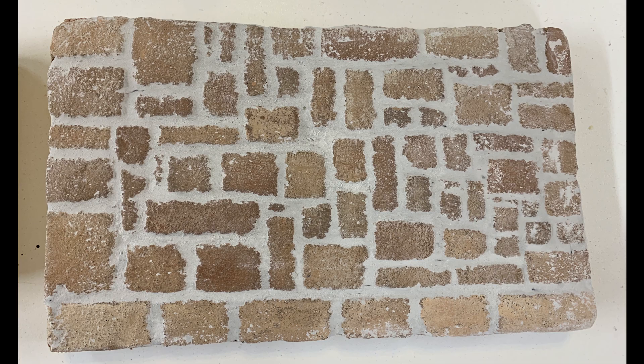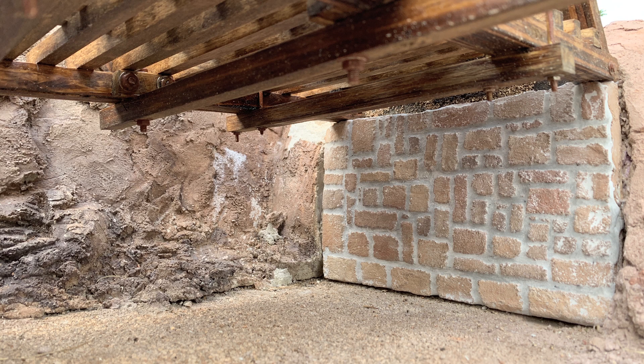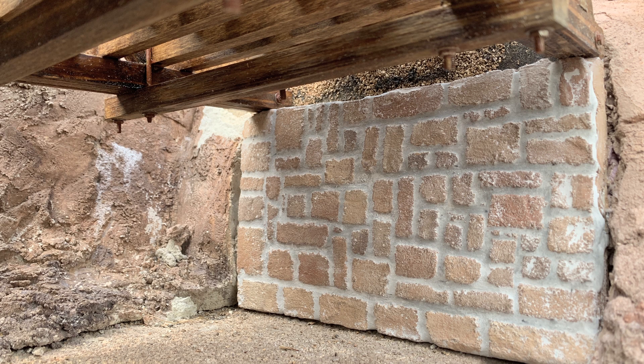When the Rockite is wet it has a deep gray color, but as it dries it turns almost a stark white - a very light gray. I was tempted to add a tiny bit of dark gray to make it not come completely to white, but then I thought the absolutely pure white mortar lines look great. A very small amount also gets down into the nooks and crannies of the stone surface, and I really like the look of that too.